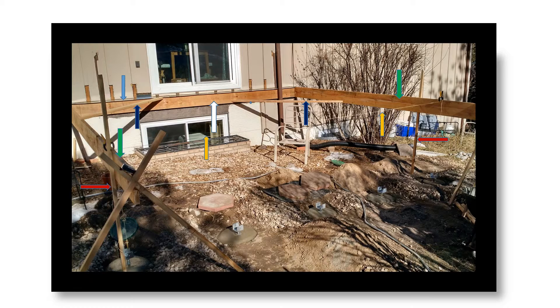The cross posts at the end of the side joists also provide support and prevent movement. Square the deck to the house by cutting the ends off two 2x4s at 45-degree angles, identified by the dark blue arrows, and screw them to the ledger and the side joists. Take measurements from side joist to side joist up against the house, in the middle where the cross beam will be connected, and at the end.